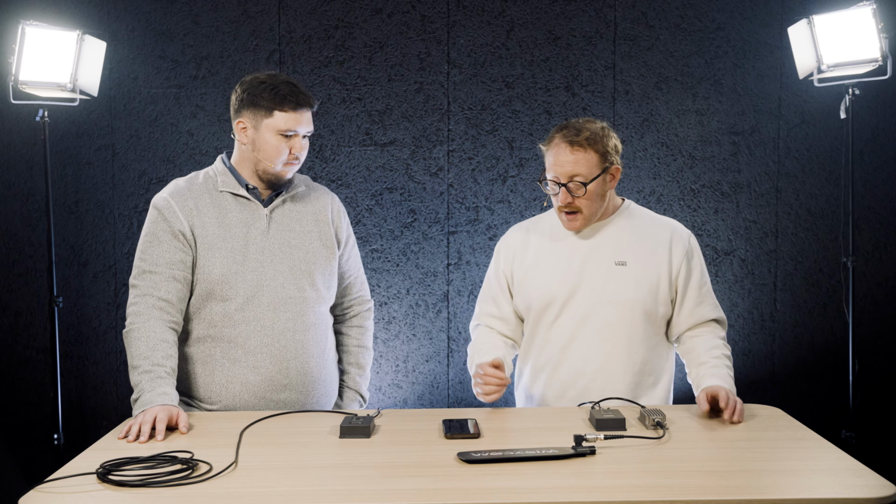That's a very important thing to keep in mind, because the typical thing that people ask, maybe they are familiar with using fiber in reception, so they place diversity antennas, and then the real limit of how many body packs or handle mics you can receive over fiber is the sensitivity of the receivers themselves. So it depends. If it's a very good system, you will have a lot of transmitters on the other side. If it's a so-so receiver, probably you have to decrease the amount. But the fiber itself is not adding problems. It's basically just solving problems.